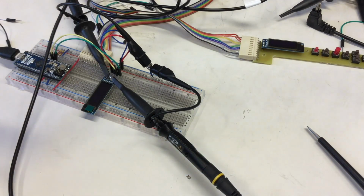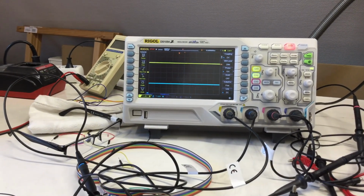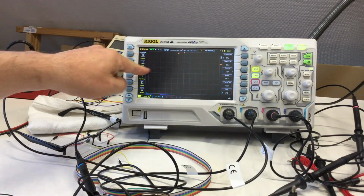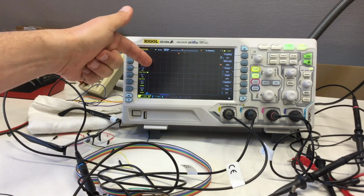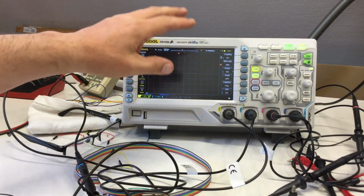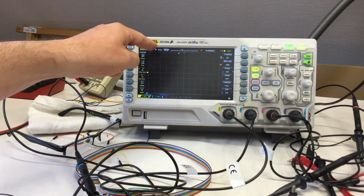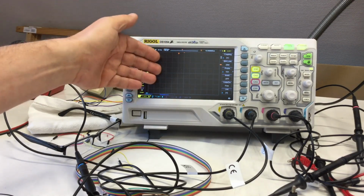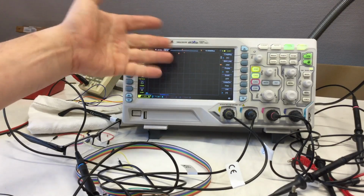and yeah, what I'm basically doing here is I make a single shot on channel 1, which will be shown in a second, on a falling edge, because I2C works with pull-up resistors. So if nothing happens on the I2C bus, it's high. And as soon as it goes low, it is basically driven low by open, in this case not open collector, but in principle, something is happening.